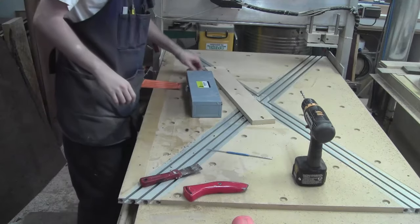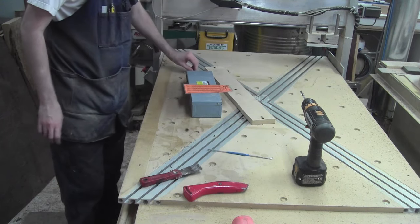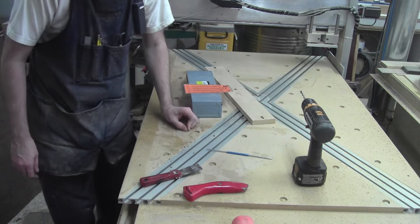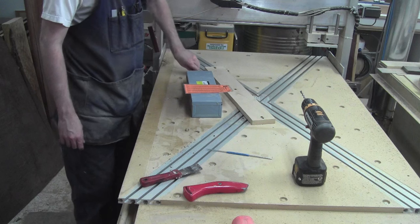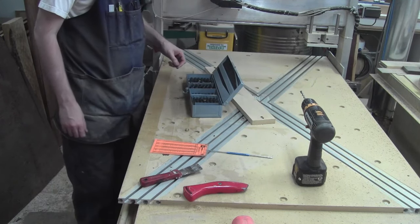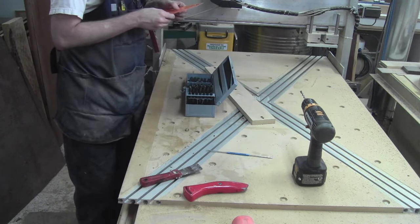Okay, so these don't quite fit, which is perfect, which means they're not slip. Oop, that one slips. Okay, so that one's good. How about this side? That hole is slightly different sized than this one. I'm going to call that hole good. If there's any shake, it's very minimal. So I just want to enlarge this hole a barely any amount. So we're going to look for a bit that is just slightly over 250. Quarter inch is 250.